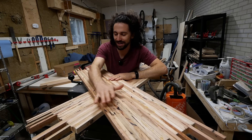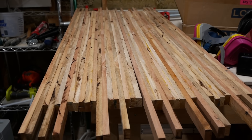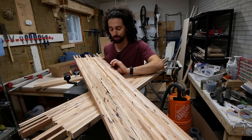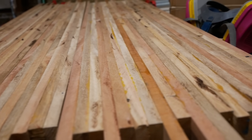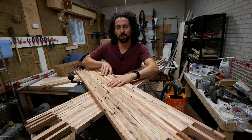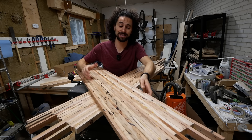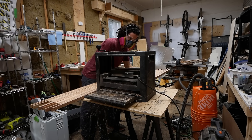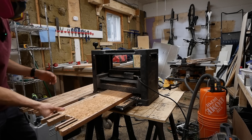These glued-up panels are looking great — I love the variation of color. I spent a lot of time arranging the slats for a nice striping effect. Now I need to plane them down smooth and to the same thickness. I have to be careful though, because these are already pretty thin — to get enough width for a comfortable desktop I had to rip each slat down to only 7/8 inch wide. We are in a van so limiting weight is good, but too thin and it won't feel nice or be very strong. My goal is just a few very light passes through the planer.